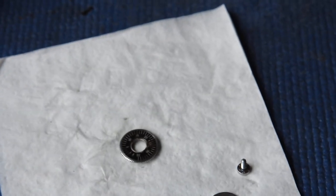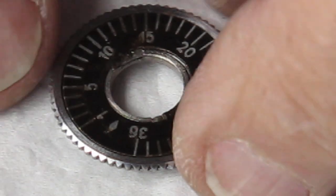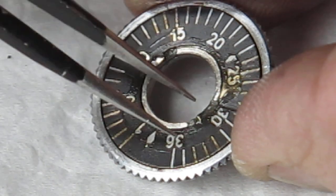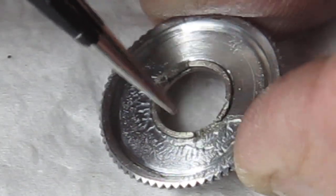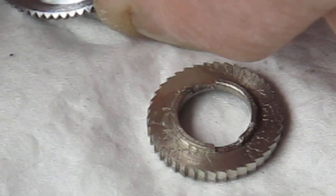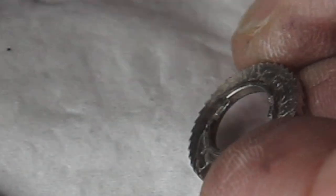The damage is here. You can see the state of this wheel — see how it's all polished up there and shiny. That's because it's distorted out of shape. And here — let's wipe this grease off — you can see that these points are damaged; they've been pushed up out of shape. And here the slots are damaged — they're rounded off.